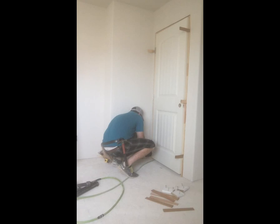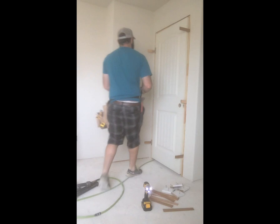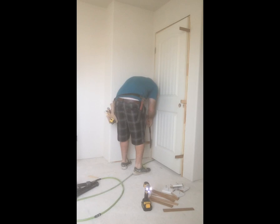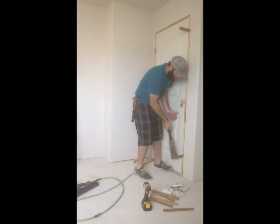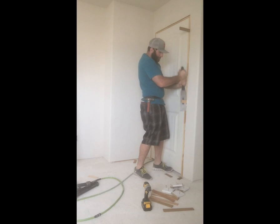I will be showing at the end of the video that I am putting screws into the sides of the door jamb — not into the door itself. You'll see it doesn't affect anything. I put the screws about 5/16 in, and with a reveal of 3/16 or even a quarter, when you put your trim around the door you're not going to see the holes. And if there were a hole, it's paint grade so it will be filled — same as how they put a nail through the door to hold it in place when you get it. So don't freak out.